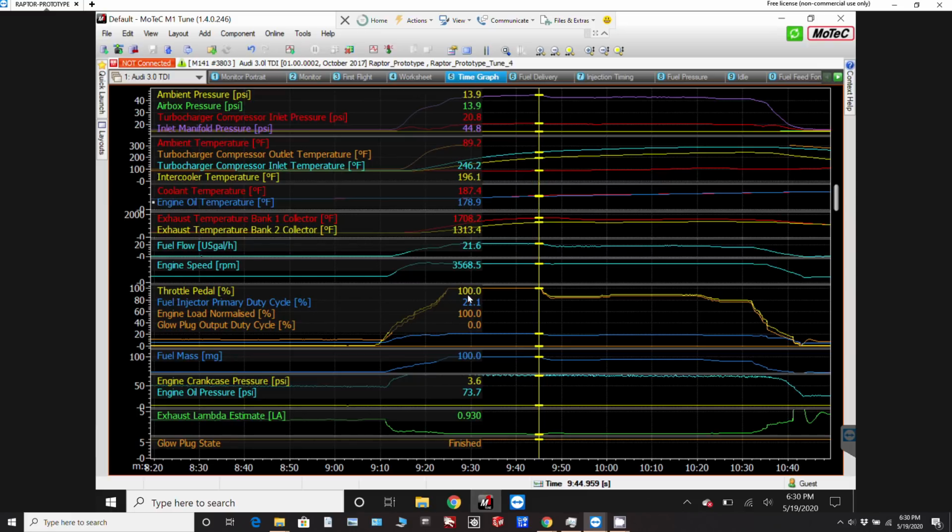So I went from 100% throttle back to 85%, at which point, if you look at the temperatures here, it starts to drop right away, from 1660, and it doesn't take very long at all, and it's back in the mid 1500s. And so looking at that, I think I can quite happily maintain, say, 90% throttle there and keep this under 1650, and that'll give us a good climb out with the aircraft without overheating anything.